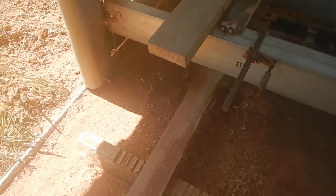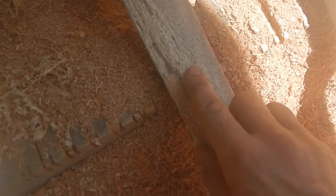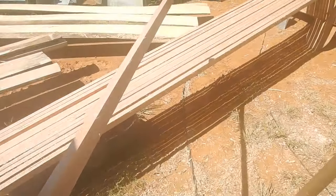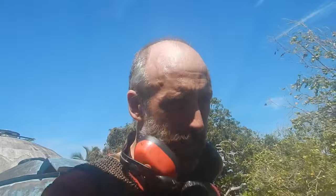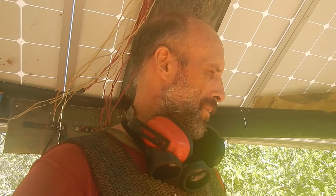What screw did I hit, you may ask? These boards are so light that I screw them down so they don't move. I hit one of these — just wasn't paying attention. When I get to this point I have to reposition the screw and make sure it's in the middle of one of the strips. It does look like the blade is now wobbling left and right a little bit, not forward and backwards. But that's okay — when it wobbles left and right just a little bit, it just cuts a slightly wider cut, which doesn't matter on a dry board but when you're cutting something wet it's nice to cut a slightly fatter cut to prevent the wood from binding on the blade. I think I'm just gonna leave it.